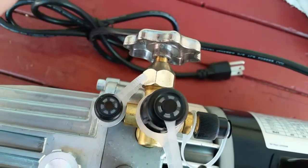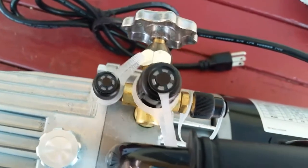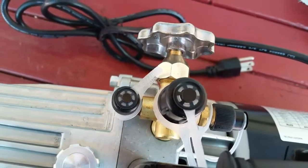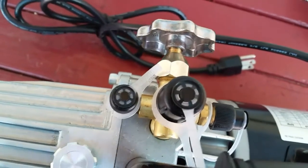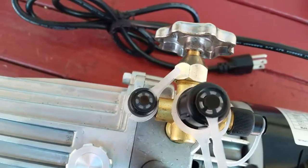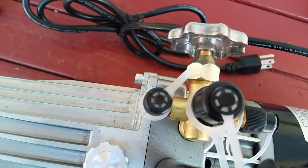And then when you go to charge, there is a similar connector on the gauge. You use that same hose that connects to the vacuum pump. You take it off the pump, put it on the refrigerant can, bleed it, make sure you get all the air out of it. And then there's a whole procedure to that, but you basically introduce the refrigerant.